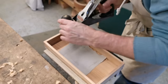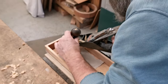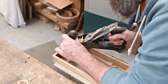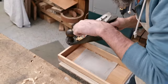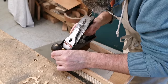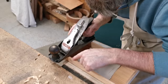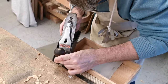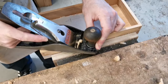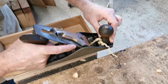I think I need to come around here again, so I'm going to go on there and I'm looking through the mouth. It's skewed this time, but the front part of the plane is on that edge side now, so I can continue up to the corner. Now the mouth's getting congested — rotate it around the corner. That piece needs some taking off, so I'm going to turn it around. Shaving started. We can take it slow, because Adam's plane is gloriously sharp.